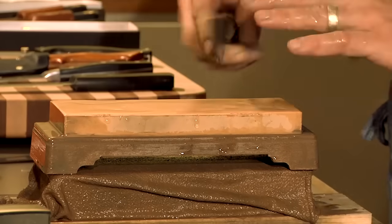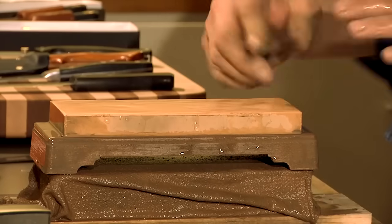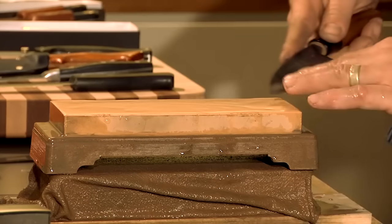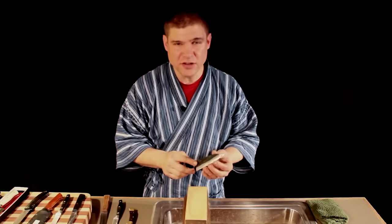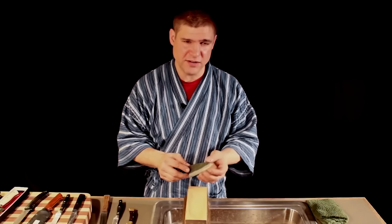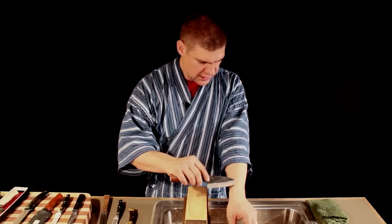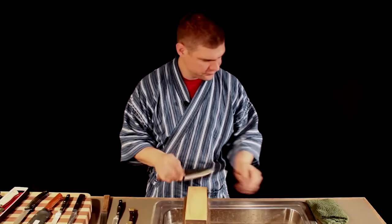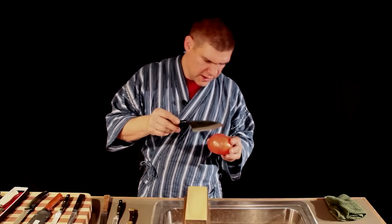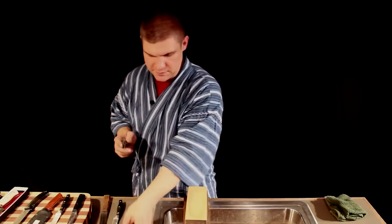And we'll come in and we'll strop once on one side and alternatively on each side. Nice and slow and nice and soft. The closer you get to finishing, the softer you can do it. Okay, now my 3 fingers are telling me that this is now a scary sharp edge. And the hairs on my arm are confirming so. They're shaving off. And on the tomato skin, cuts right in, with the littlest of motion.